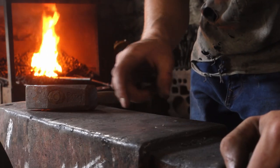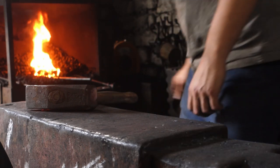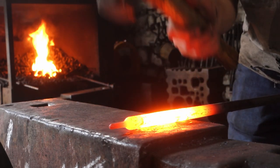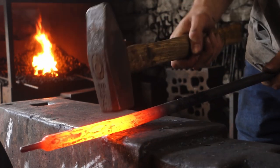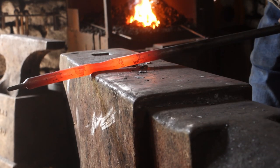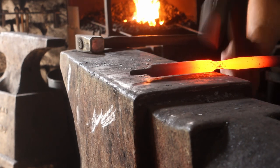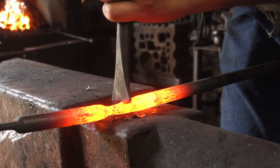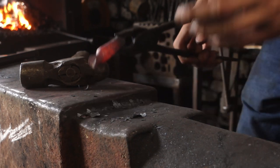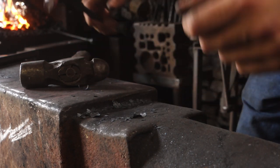Now the end's forged out, I'm going to texture the section of 16mm bar which is going to stay solid, and then go to the back and forge the second isolation down to the stem. Now that this is off the bar, I can forge a scarf on the end of this little piece of material and then a scarf on an 8mm round bar, and then forge weld the two together.